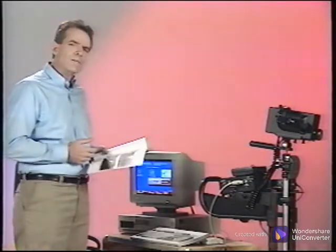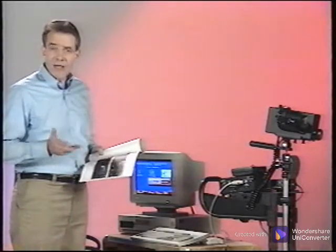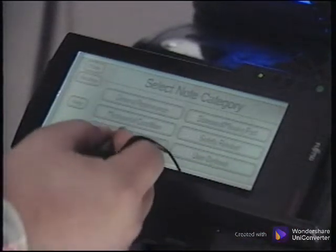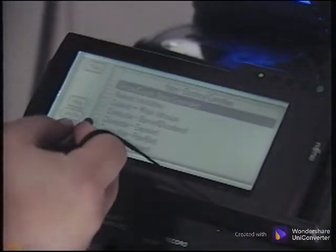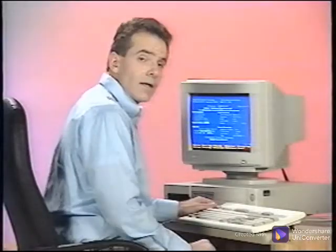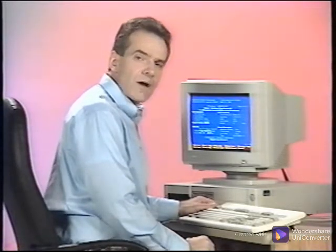Thermographers complain that it takes too long to compile the information and get a report back to the customer. Customers complain about a 3 or 4 week turnaround time. A good system documents the essentials and takes the headache out of the paperwork. The notes are already electronically recorded in the field, which will spare many hours trying to sort notes, find notes, or recall information. The information is downloaded to the computer into CSI's infra-analysis software, where a database of records and images are kept for each machine.